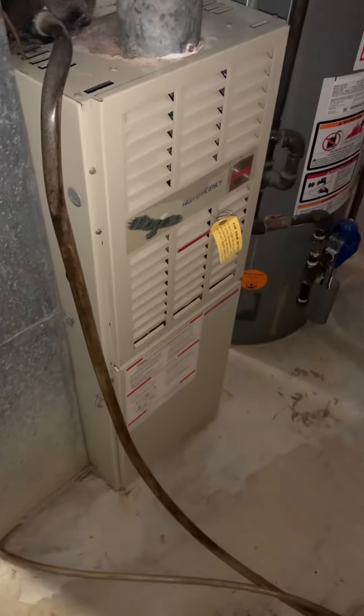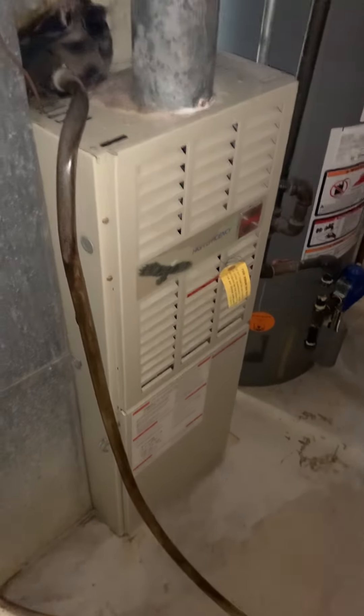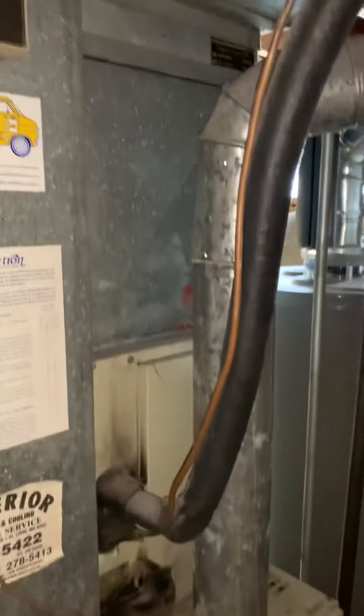Taking a look at a 66,000 BTU furnace — looking at replacing this evaporator coil, supply plenum, new return air drop, new humidifier. The line set is actually quarter inch, which is undersized and needs to be replaced as well. New condensate drain running over to the floor drain, and the line set just goes out right through here.